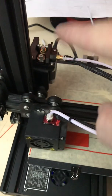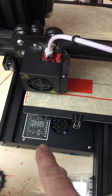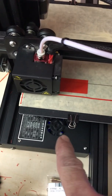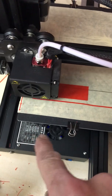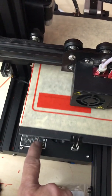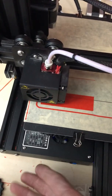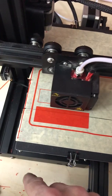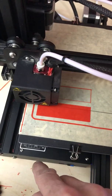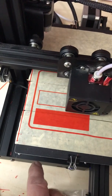There's a video in the doobly-doo that tells you what the VREF voltages are. Take those two screws out — there's one in the back — pull that off. On the board there are some pots for X, Y, Z, and extruder, and it tells you what the voltage should be.